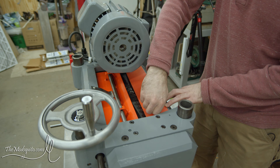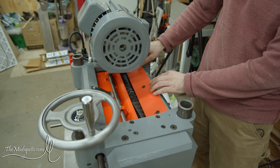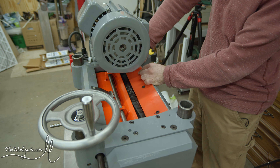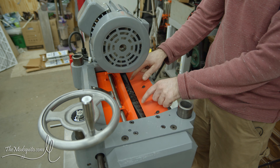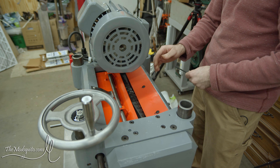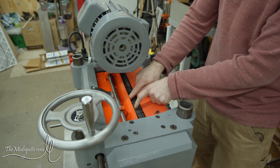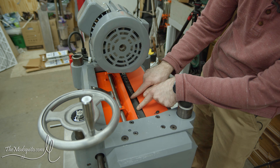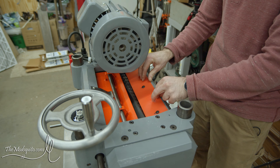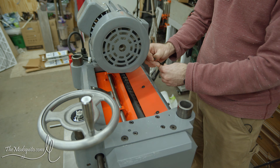It fit either way, and you could always make your own too. What mine had originally come with was a little chipboard piece cut to the right size with the right holes. There's a bevel on the inside edge, and the idea is you set it as close to the cutter head as you can get without actually hitting it, so chips get deflected up and out of the machine.